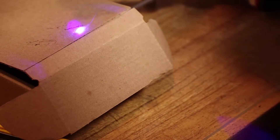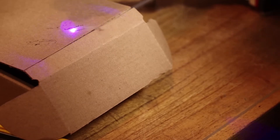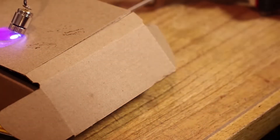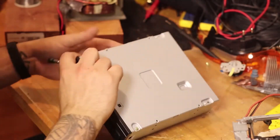I turned it on since I had my regulated power supply and know quite a bit about laser diodes. But in your case, don't connect it to anything yet, as they are very sensitive components — if it's not well regulated, they burn. So be careful; you don't want to damage the whole Blu-ray reader just to try out the laser.